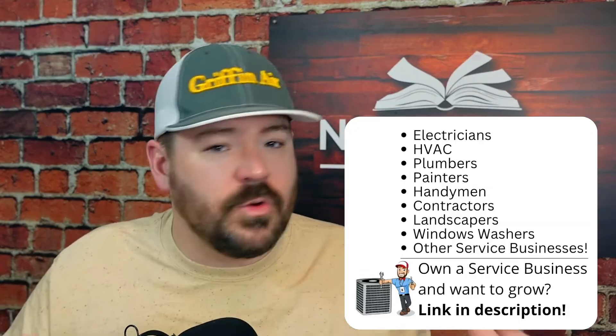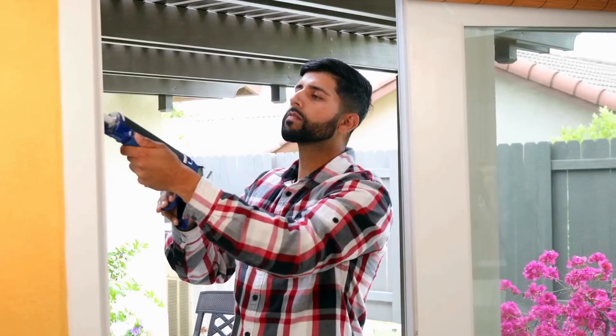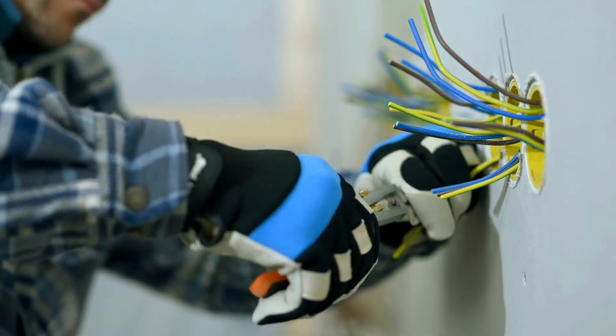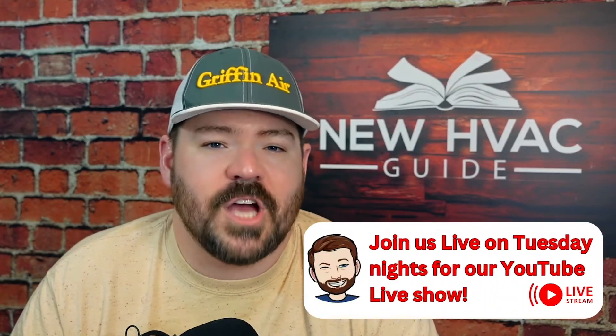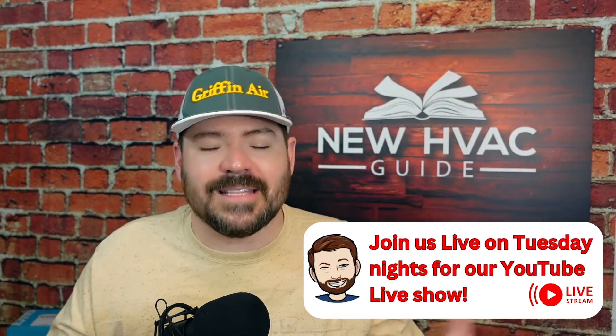You don't want to do anything permanent. You don't want to get in there with caulk or something you squirt into that hole, because now you're affecting someone in the future trying to work on that system. I've actually worked on thermostat wires where somebody did something like that and now I've got to pull another wire or use one of the other conductors in the cable, and I'm not able to get to everything easily. I would definitely caution you against that.